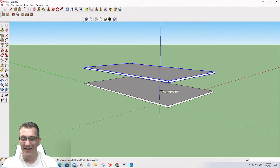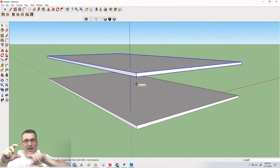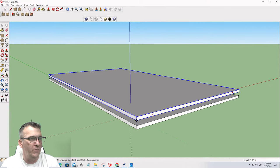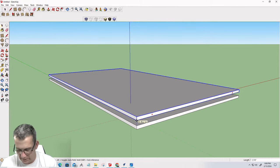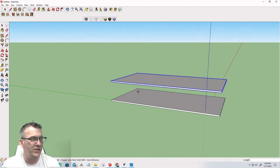All right, ladies and gentlemen, we're gonna start again. What John said was what made sense was 2 inches on the top, 2 inches on the bottom for the side rails. So that's the thickness of the top and the bottom, not counting the cutout where the drawers are gonna be. So basically 12 inches. So I'm gonna bring this back down and touch it off here at the top. I'm going to move it up again just a little bit and type in 12 and move that up. It looks crazy when we're out here. It looks like it's up a million miles, but it's only 12 inches.